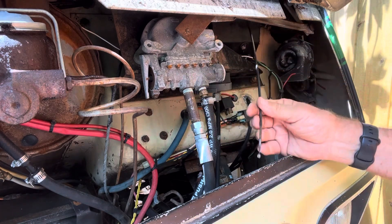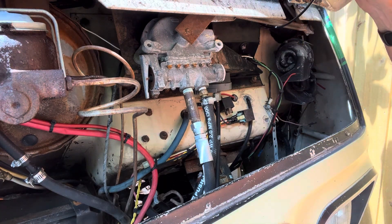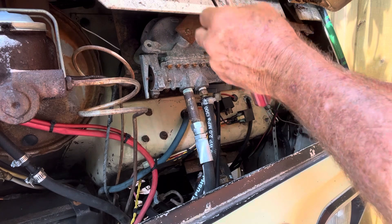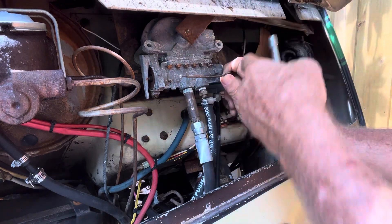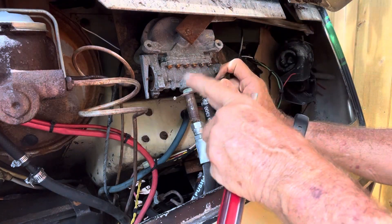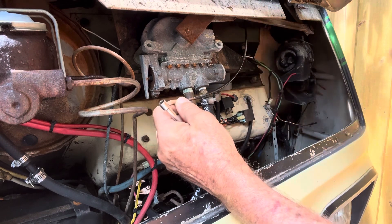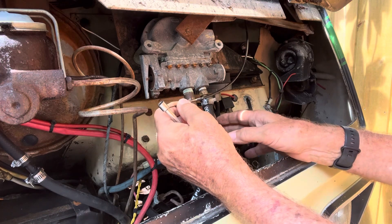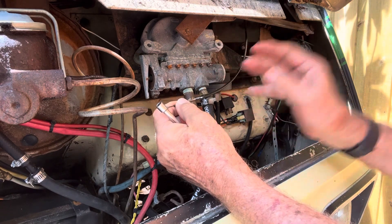If you want to do something good for this thing and you don't want to go into the dash, hold this thing up as high as you can and drip some WD-40 or penetrating oil down this cable as much as you can, then go up top and move it back and forth. If you do pull off the back of the dash, you can get to the top of this cable and run a little bit of penetrate down there because it will go down the path of least resistance. You need to get this cable lubed because you can't replace it. Now, up in that handle — if you do take that apart, be real careful with it. My suggestion is leave it in place and just lube it, because there's a spring and a small ball bearing that hits detents. So be real careful that doesn't come apart.